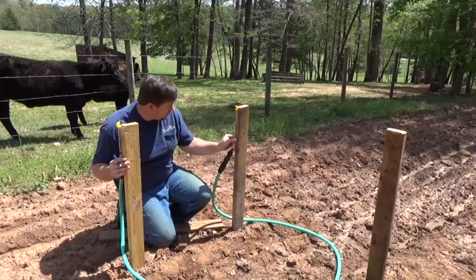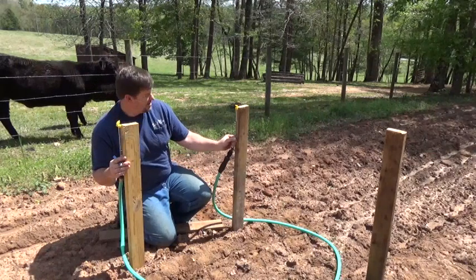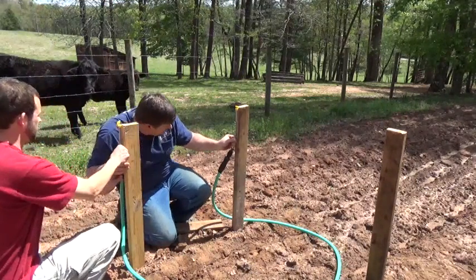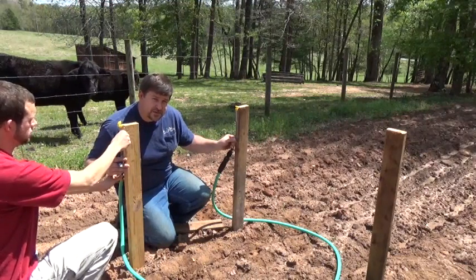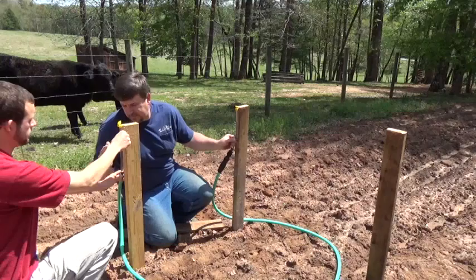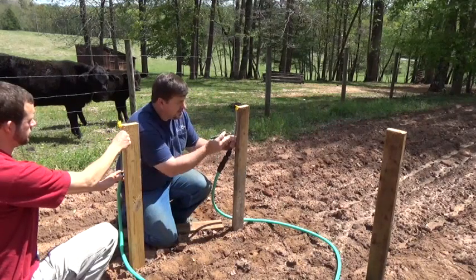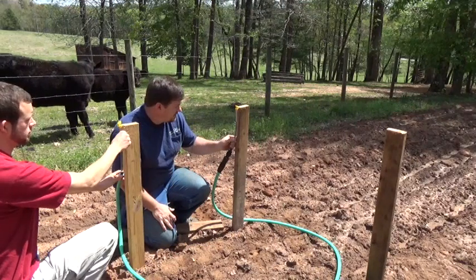It's pretty easy to see with the clear tubing. I'm lining up on my pencil mark here, and I need to line up on my pencil mark on the other side. So if my assistant holds that tube there, I'm pretty good. You've got to decide whether you want to read the top of the meniscus or the bottom of the meniscus on the water bubble. I'm just going to read the top — it's easier for me to see the top than the bottom. So I make my mark, and this will be my calibration mark for everything I do on this building.